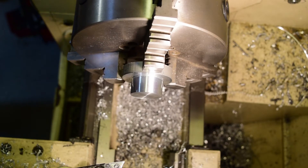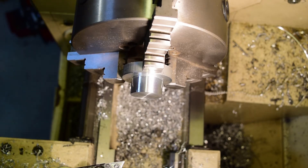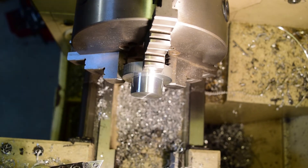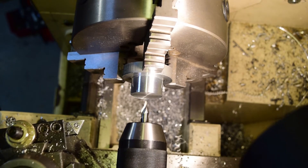I have a one inch Silver and Deming drill. We've got a lot of margin — it'll be a quarter of an inch thick still, so that'll be fine. Famous last words, right. This is a rough operation — I wouldn't normally care about center drilling, but this Silver and Deming will really wander in this particular tailstock setup that I've got.